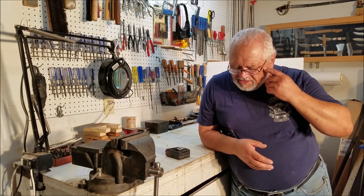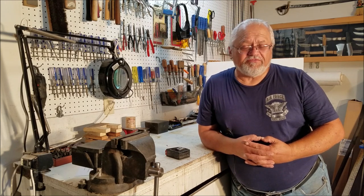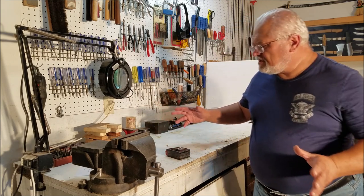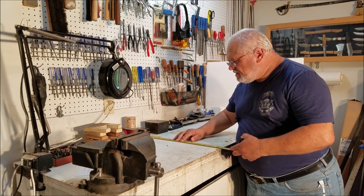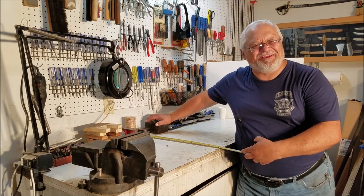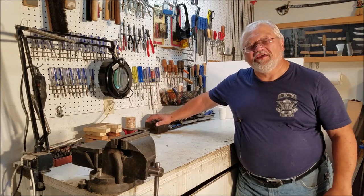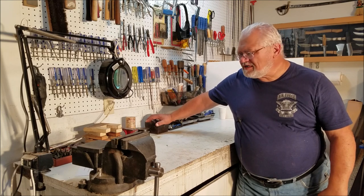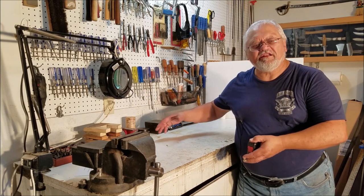First, let's talk a little bit about the bench. Most people don't give the bench much thought, but there are a couple of things worth considering. First, the depth — make it about two feet deep. The back of the bench tends to accumulate garbage, tools, and things that get shoved back there. The deeper it is, the more junk you'll have back there. Two feet will give you enough room to have some stuff back there and still enough working room.